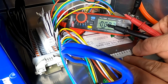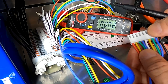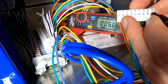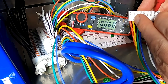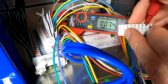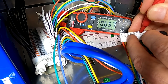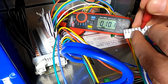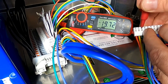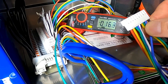Before we connect the balancer, we want to check the voltages on these connectors. All these connectors have a little opening where you can access the contacts. Starting with the negative probe on the black cable and the first positive — this should measure the first battery voltage: 3.28 volts. Moving the positive one contact further measures two batteries at around 6.5 volts, then three at 9.8, then 13.4, 16, 19, 23, 26.2 — they are all perfectly well connected.